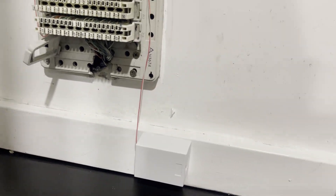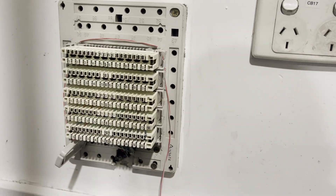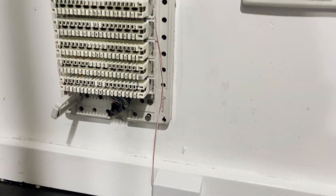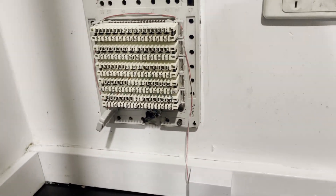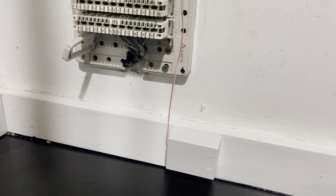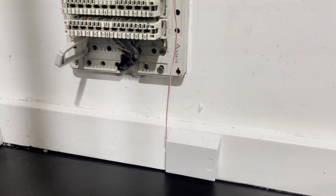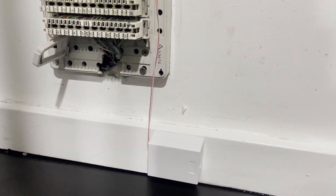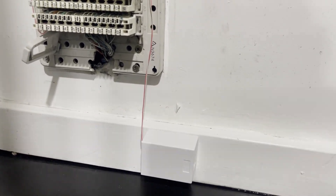We've added a socket here. There's no cover for it — they didn't want to replace anything — so basically just connected a socket up, put it into pair number one, and I'm going to move this thing back in place so it won't get knocked off. We're going to sit the router up on one of these shelves. I'll put on my F-set now and send this tone down to the MDF to trace it out.